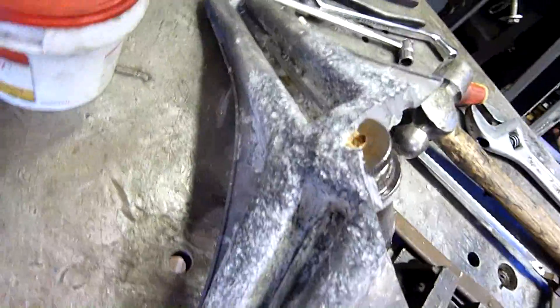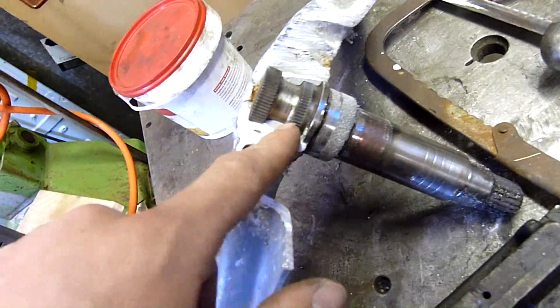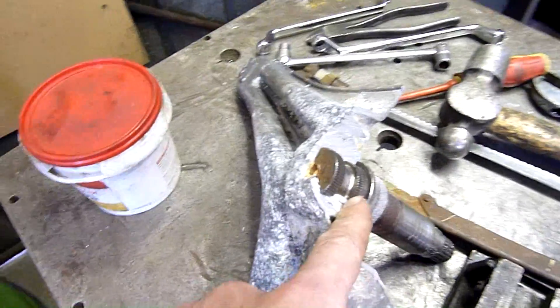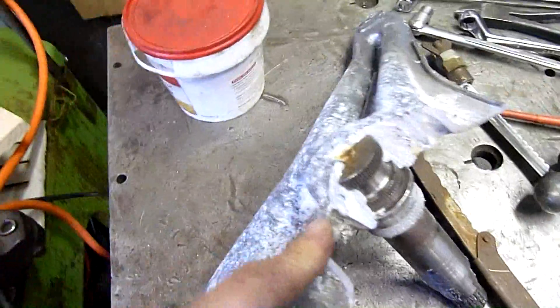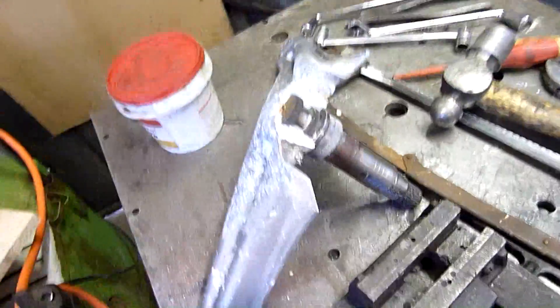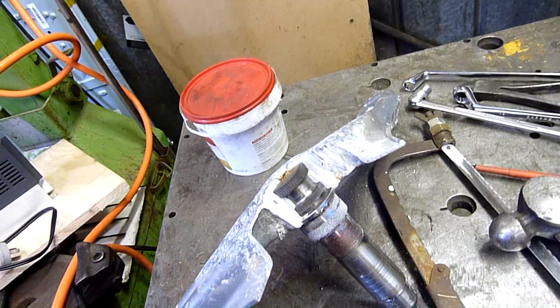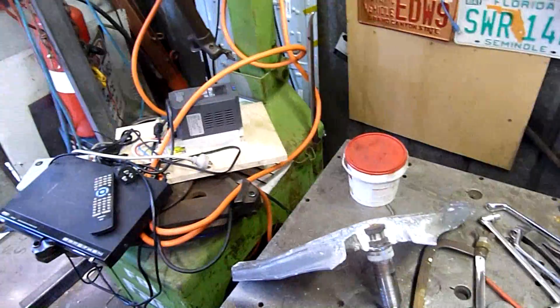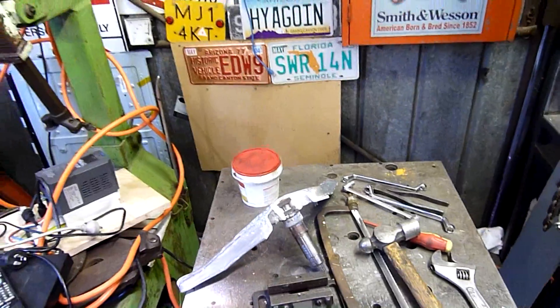It's going to take a bit of horsepower to spin it, but as you can see it's well and truly cast in — all just cast in the die — so I'm going to have to split it three ways instead of two. I've got to cut down here again with the hacksaw. I could get the grinder out but it's 40 degrees outside and it's total fire ban, so I don't think people would like me running an angle grinder. I want to minimize the use of grinding and cutting tools that create a potential fire hazard because it is tinder dry outside.